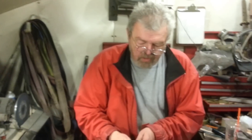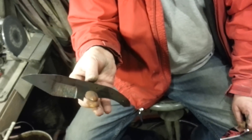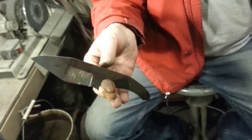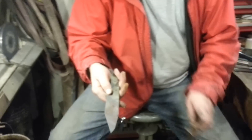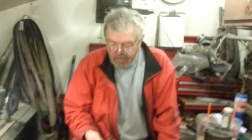Fantastic job. What else did we do? We got a bunch of stuff done — yesterday we heat treated knives, today we tempered them. That 440c knife we finished tempering today is at 57-58 Rockwell, which is where we like to go on 440c. It's flat ground with a crease — we like to have a crease in it. We did that one on my machine — flat grind on your machine, how awesome was that?